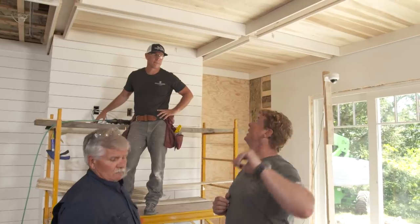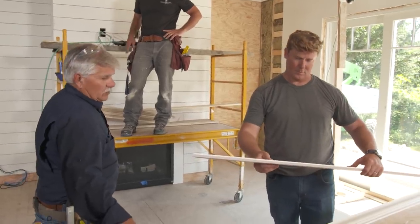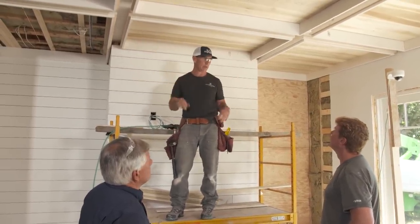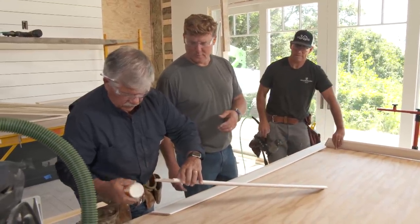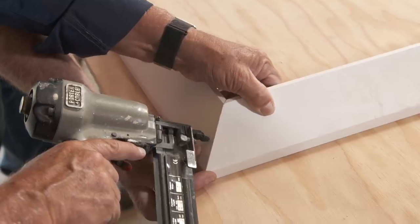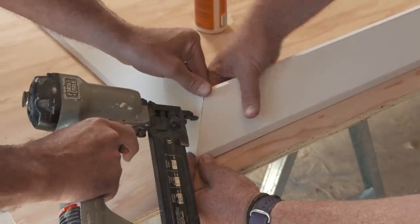Most of the coffers are filled in — time for the crown molding. We're getting ready for the crown molding. As soon as the board's up in this bay here, we're going to try something different. Instead of coping, we're going to take these units and picture-frame it — put it up as one unit. We're going to put some glue, tack it with a pin nailer, and then actually drill a hole and put a screw in it. With this picture-frame idea, no coping involved, so that speeds it up. When you have a small series of squares, it's just quicker to do it this way.